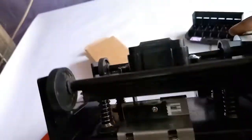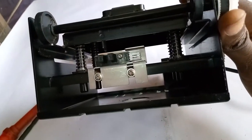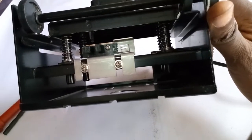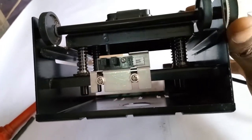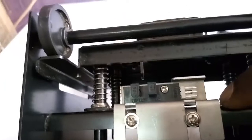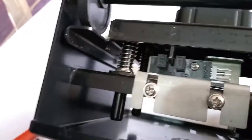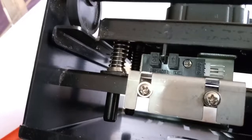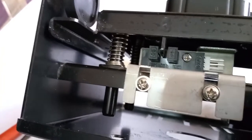That's the function of that sensor — essentially a limit sensor. Don't forget this is a mechanical device; it doesn't have enough sense to know when it has gone too far. So you need a method for controlling the distance of the movement, and that's what these sensors do. On a CNC router, for instance, they call them limit sensors — they don't look like this but pretty much do the same things. The function is to stop the cap from moving too far down and damaging itself.